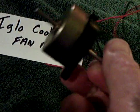It's just something I want to share with people - these little Igloo thermoelectric cooler fan motors. You can go to their website and find them, or you can scrounge around for one like I did and take it apart. It's four poles, and the poles on the magnet - which is one of these strip kind of magnets - is north, south, north, south, north. There's four poles. Then there's four coils on the stator. You have to disassemble that circuit board and connect the wires just right. It's basically two coils wound together in series, which gives you two basic coils of a Bedini SSG. You have to fiddle around with how you wire them into the circuit. But it does work. Just something to fiddle around with here while I'm waiting for New Year's.